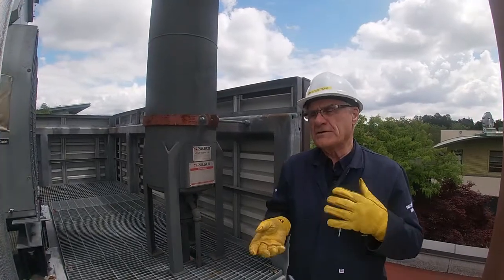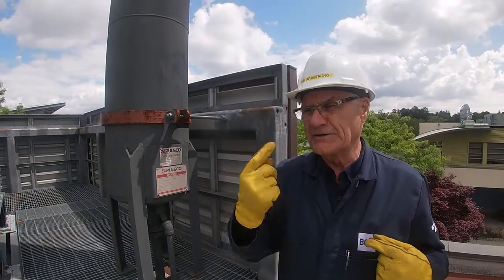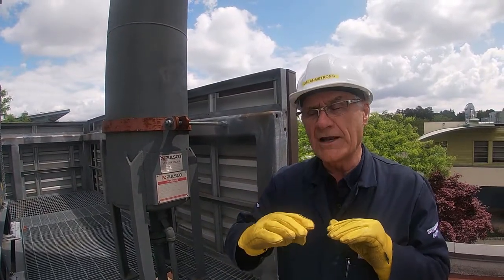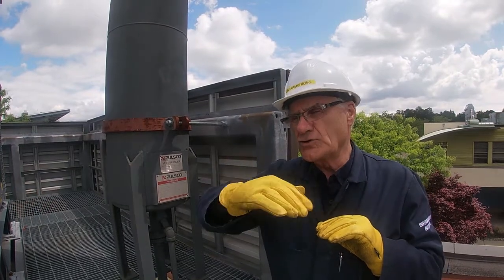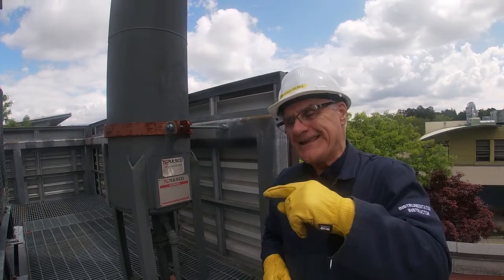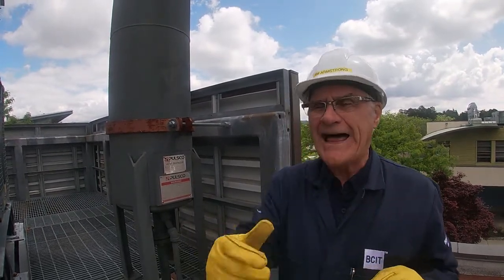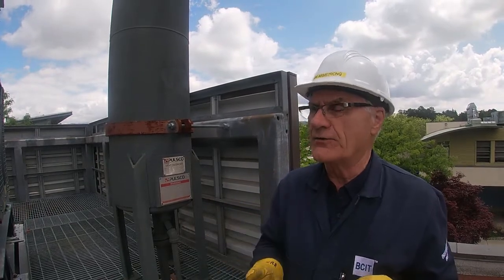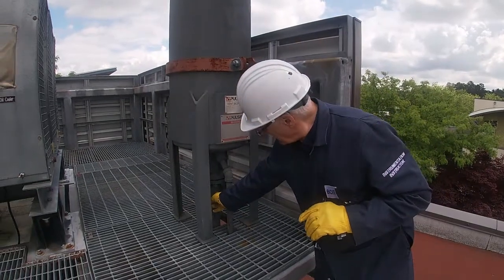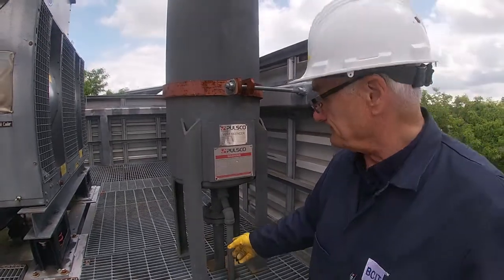When we first go to start up the steam turbo generator, we've got steam coming through the lines. And because we're shut down for a lot of our time, there's actually corrosion occurring in the lines, a little bit of scaling and stuff. So to make sure that doesn't get into the turbine, for the first 10, 20 minutes, we actually blast the line. It's a process that we go through, and we send the steam out, and it comes up through this line down here at 250 PSI.